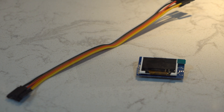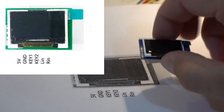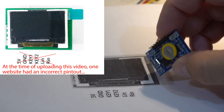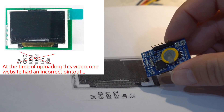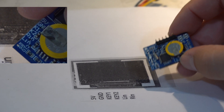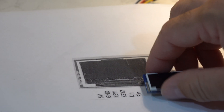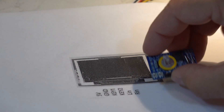The first thing we had to do is figure out the pinout. The diagram on the website shows five volts being kind of opposite that green screen protector tab, but that turns out to be wrong. On the back of the board it shows the five volt pin close to the tab. I trusted what was on the board and it turned out to be right. Just a word of warning: the pinout on AliExpress is wrong.